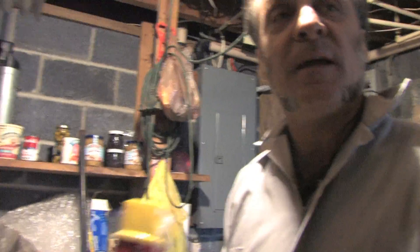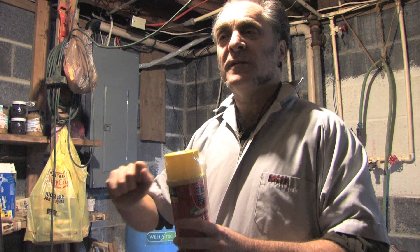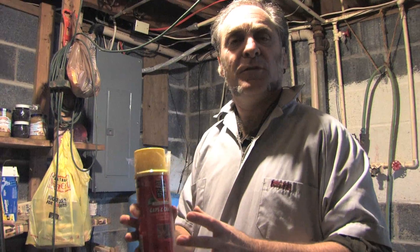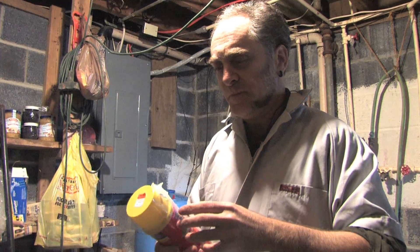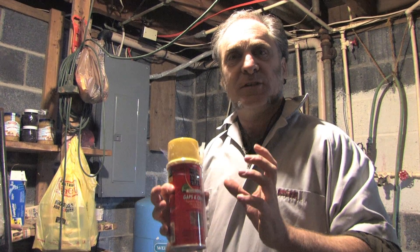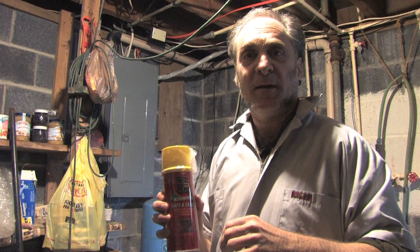The only downside — a few things. It's an expanding foam, so shake the can up a lot for a good 30 seconds at least before you start using it. It expands a lot, so do it slowly because if you go too fast, there are places where it's going to expand and actually kind of fall off. But where you have large gaps to fill, there's nothing better than a one-part expanding foam.